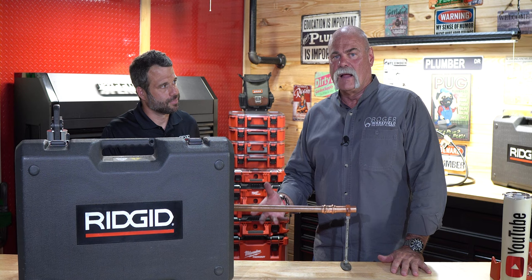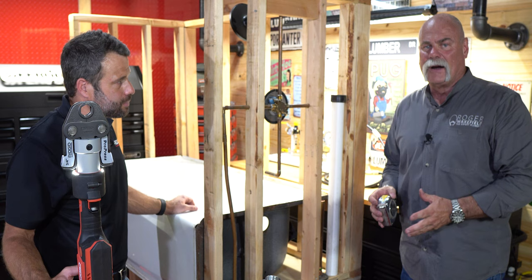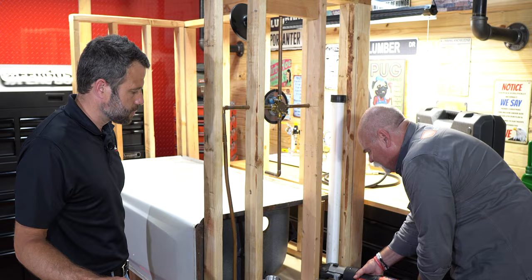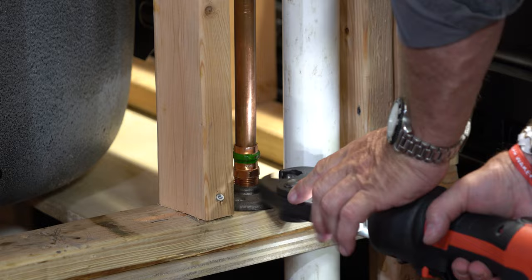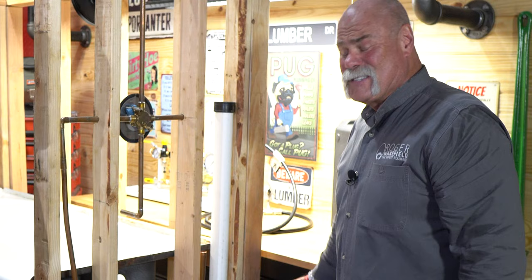We're going to roll a tub in and set up a really tight area to work in. We are one and five-eighths inches off the stud — a pretty tight area. If you were soldering in here, you'd have to worry about burning PVC pipe or wood. We're going to get in there with the RIDGID RP351. Open up the jaws, get it where we want. In control mode, press the button and it locks in. I can make sure everything's straight, plumb it up, come back, press again, release the jaws, and I'm good to go. A solid joint — with the light in there I can see exactly what I was working on, and I didn't burn the wood or the pipe.